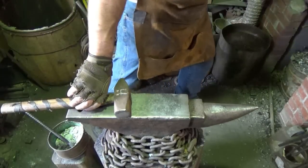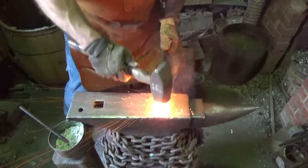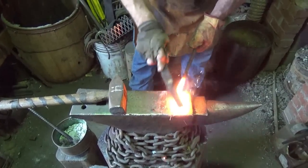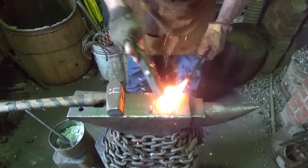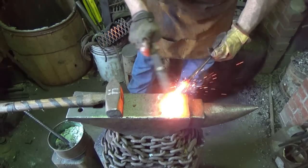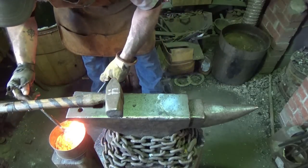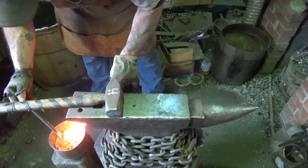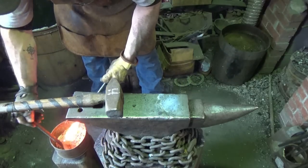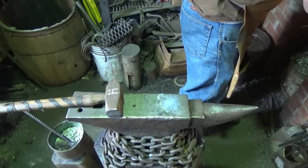This time, I'm not going to come at it crazy hard, because if I hit an oblique, it's going to try to move. We're getting awful high here. So that first weld, I'm just hopefully setting it. It's kind of going back to my normal methodology. Normally I don't come in hard like I have been today, but I knew I had some meat to go through. This time, because we are so tall right now, I'd come in and just set it, and then we'll come back and go to town next time.